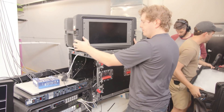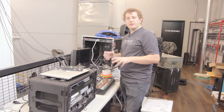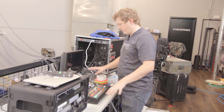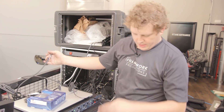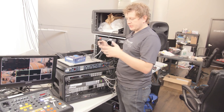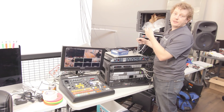We'll put this larger monitor on top to be the line cut so we can all see it. I still have to do practice and research with the Grass Valley interface on how to do the DVE inputs for the images. I'm going to build it in the software and then go to the interface to cut it. Computer software is talking to the back end of the switcher. We basically have two different main lines — audio and video — and they stay in their own independent worlds. The only thing that really crosses over is the iMac. I'm routing the Teranex as the feed for computer video playback into the switcher on input 7, and it's going to break out the audio to XLR so I can send it to the mix for playback in the house.